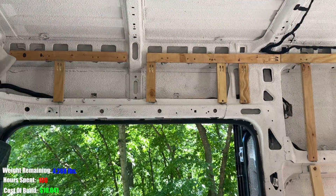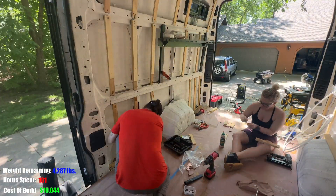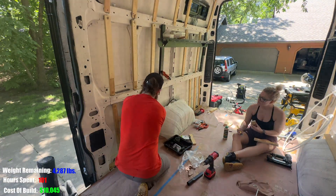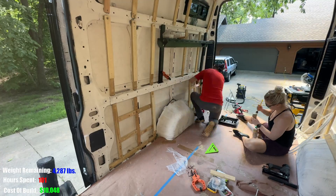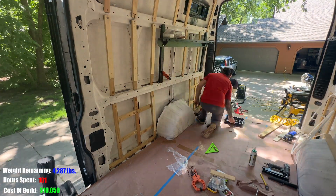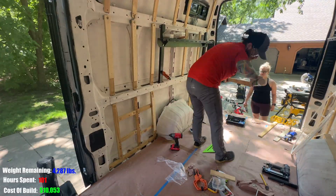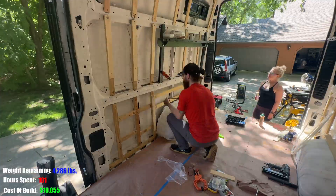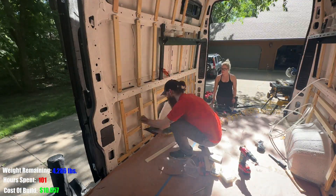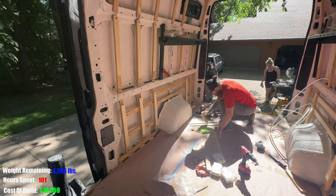For some rails I had to sink a few of them. After all vertical supports are installed, I went through and installed horizontal cross beams to provide more support where I'll be attaching heavier components such as electrical and plumbing, just to give it a little extra rigidity. Over the top of the three-quarter-inch ply on the bottom one-third section, I overlaid that ply with another half-inch ply.